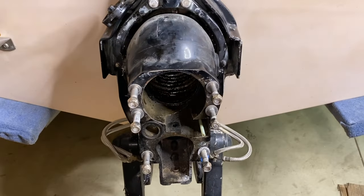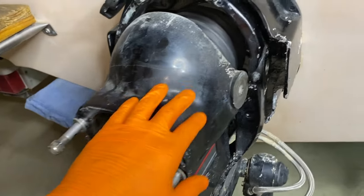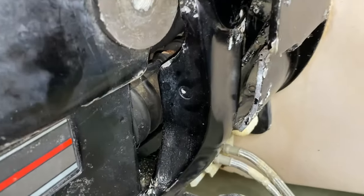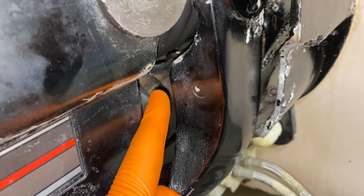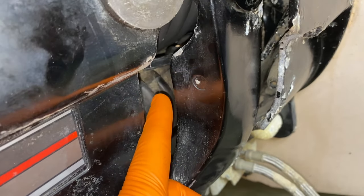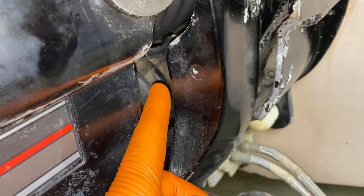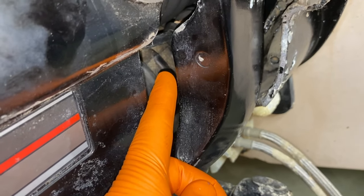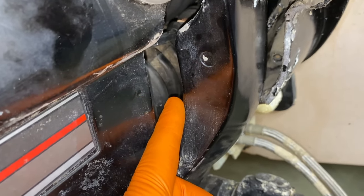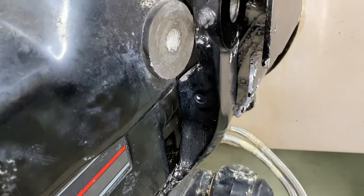Alpha 1 Gen 1 owners do not have that internal locking ring. Shifting the bell housing to port side — Alpha 1 Gen 2 and Bravo owners have an internal oil line in here; do not mistake that for your shift cable, which is right there. That oil line feeds up to the reservoir on the inboard portion of your engine. At this point, use the cutting tool or utility knife to cut that oil line, and ensure you have something down below to catch the oil.